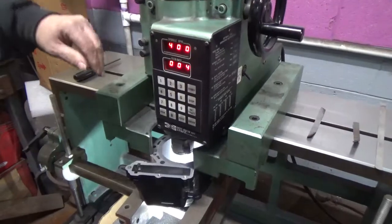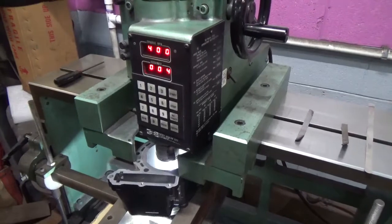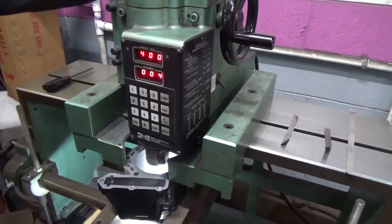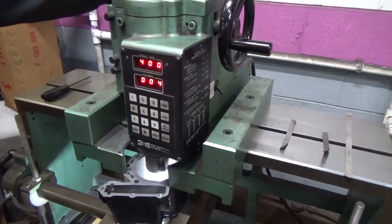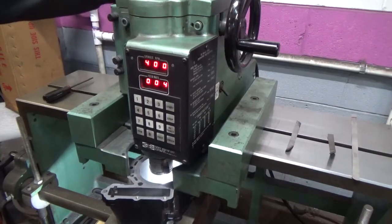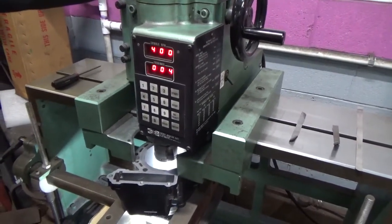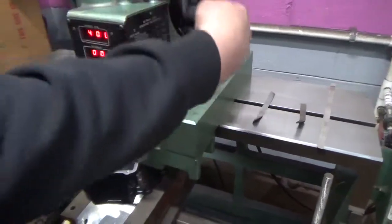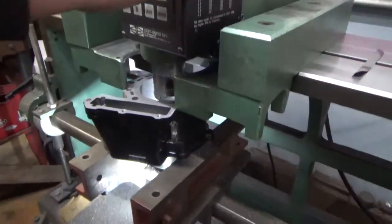We are on our final pass. We split our dimension — a little bit bigger than a third, a third, and now the final third — which is going to be a lighter cut at a little faster RPM. It's going to give us a nice finish, and after that we're going to hone. We've taken out nearly a hundred thousandths, so it's going to give us about four to five thousandths to hone. We'll bring you back when we're done so you can see us hone and put the proper crosshatch in here.